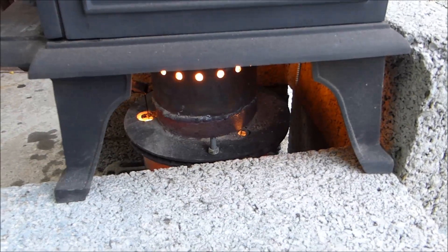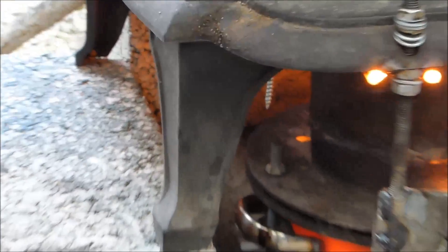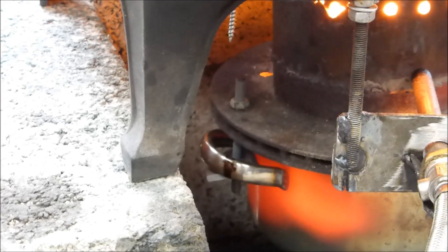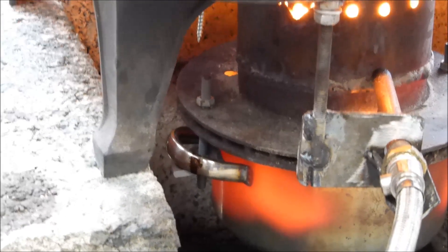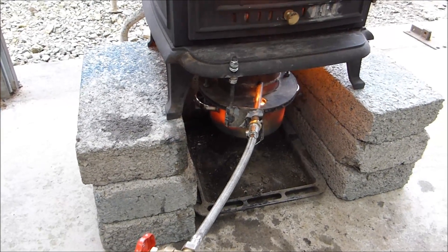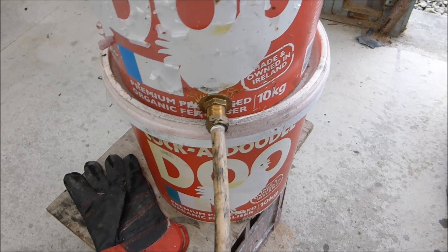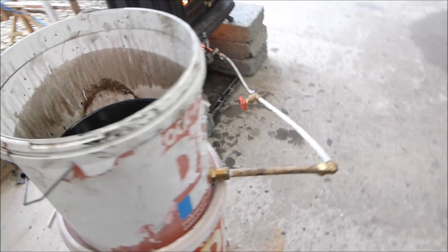Around the brake disc I have two 12mm holes — one there and you can just see the other one there. All I have is two pieces of threaded rod down to two big washers, holding the handles of the pot and pulling the pot up tight to the brake disc. Some half inch copper pipe dripping the oil directly into the hole, some flexible tube, a half inch gate valve, some half inch pipe, a half inch elbow, and a half inch tank connector. And dirty black waste motor oil. And that's it.